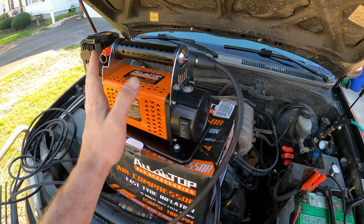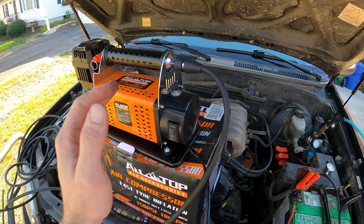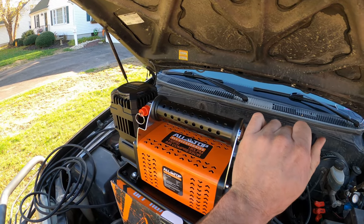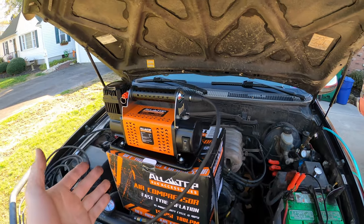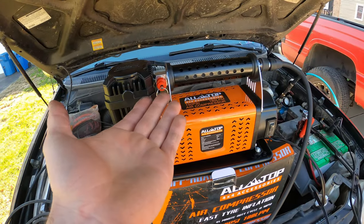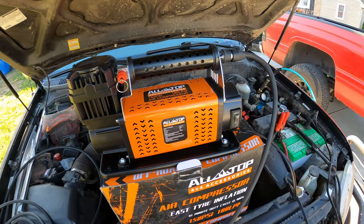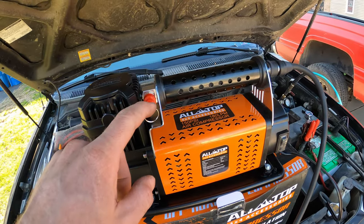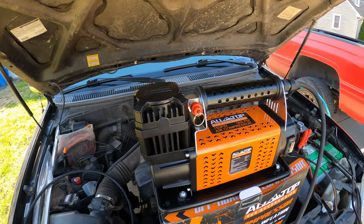This is common to pretty much every portable 12-volt compressor I've seen: it doesn't have a pressure shutoff switch. When you turn it on it just keeps going — if you kink off the hose it starts hitting that blow-off valve, which blows off at around 140 PSI according to the gauge. I wish it had a switch built into the power lead to shut off at 150 PSI. Make sure your blow-off valve works, otherwise you're going to rupture the tube, hose, or cylinder head and it could hit you in the face.